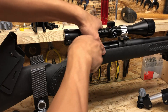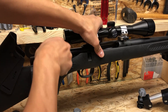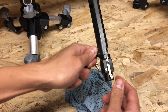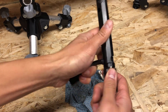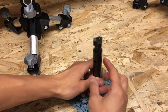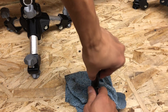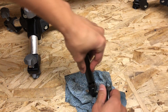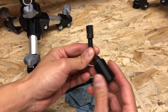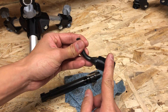If you prefer to install the bolt handle with the bolt out, I'll show you how to disassemble that. First you need to take the bolt out — the bolt releases in the back of the rifle. Next, grab onto the bolt handle and spin this lower assembly counter-clockwise. Then place the bolt like this, push down hard, pull the bolt handle out. So if you prefer to do it this way, you can take the bolt handle out, put it in a soft jaw vise, and install the extended bolt handle.